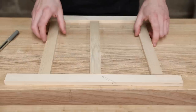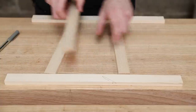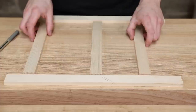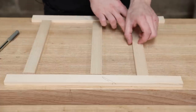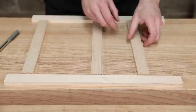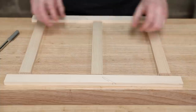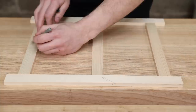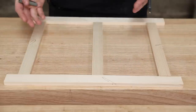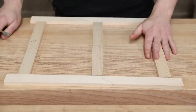Now with these components here, let's see, I've got two with quite a wide grain pattern on them and this one's got quite a thin grain pattern on them, so I might as well make the two wider ones on the outside and the thinner grain in the middle just to make it symmetrical. And on these outer components, it kind of tapers from thin to wide grain, thin to wide grain. Because this is thinner in the middle, I'm going to have it so the thin grain is also on the inside, and on this one, the thin grain is going to be on the inside, but I prefer that face there. So those can be our face sides and edges. So face side, face edge, face side, face edge. And then this one in the middle, obviously there's no particular orientation that can be, so let's just make it the left-hand side because I'm left-handed. And there we go, that's the orientations done.